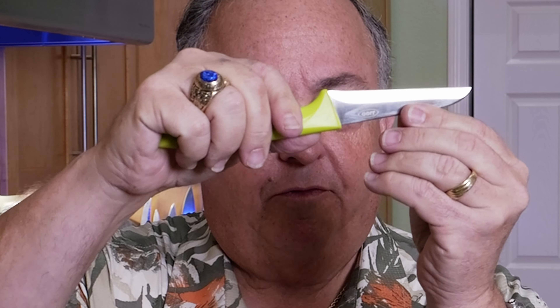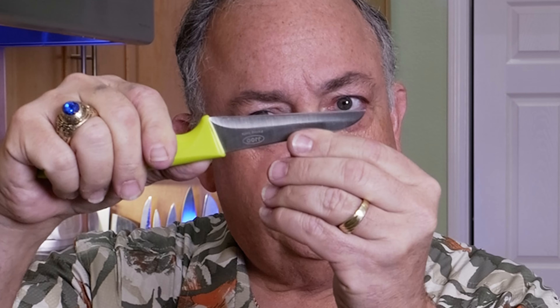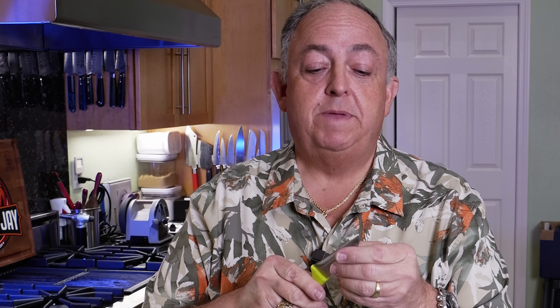On this 700, looking at the edge, I can see that all that real rough top now looks pretty smooth. Someone will probably comment that I didn't check for the burr — I do that on the other videos, rolling my thumb up to see if I can catch the burr. One thing I've learned is that you will have a burr you may not even be able to feel, which they can show you under a microscope. There is a burr when you sharpen one side, however slight — it generates at the very edge of the apex.